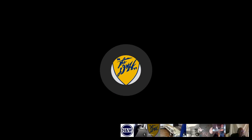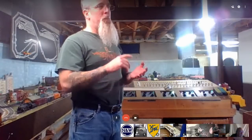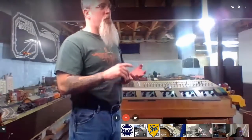If you want to go to DCC, you would have to remove that board and replace it with a DCC decoder. You could rewire it and get rid of that board. Just direct wire it, I guess. Go direct is my best option. You could do that, and that sure would eliminate any slowing down and speeding up. It would make it a dumb system. 2 wires from the track to the motor. Right.